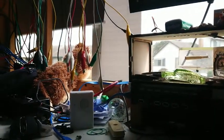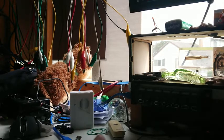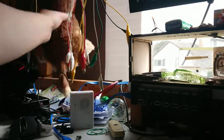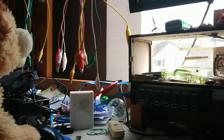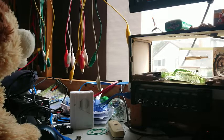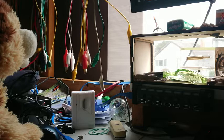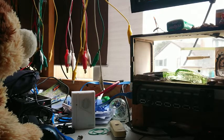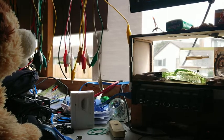Now the problem I had before is when I drive it upwards from the bottom it would clip. There's my apprentice's toy, Waffles, that needs some repair — and I need to clean up my desk. Okay, good. Let's go the other way — we'll wind up now. It was slipping when it would drive up before, and we now have no more slip, so that's good. Our electric blinds work again!